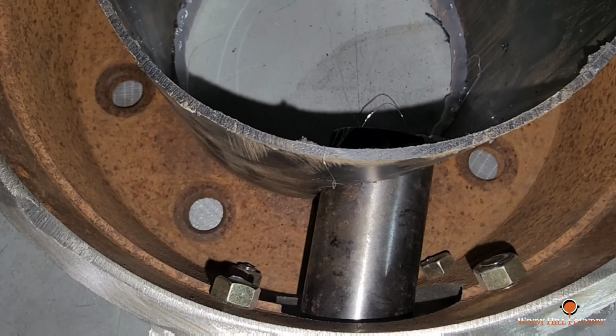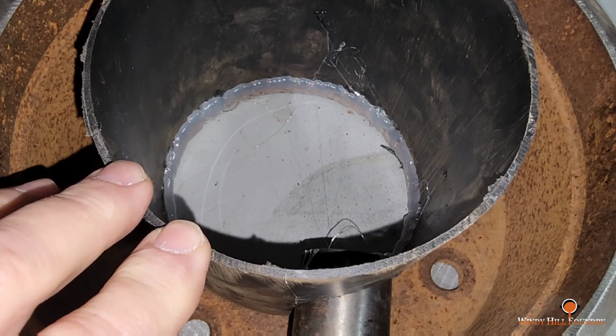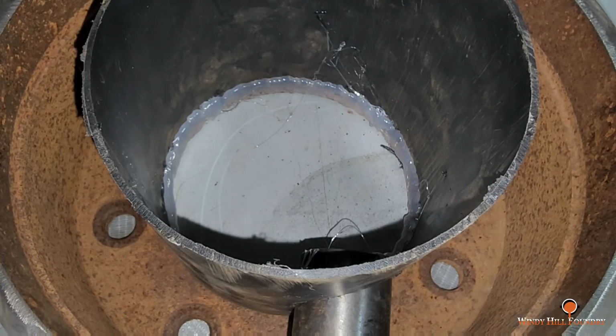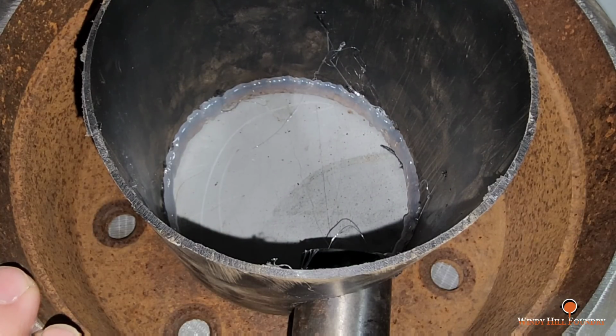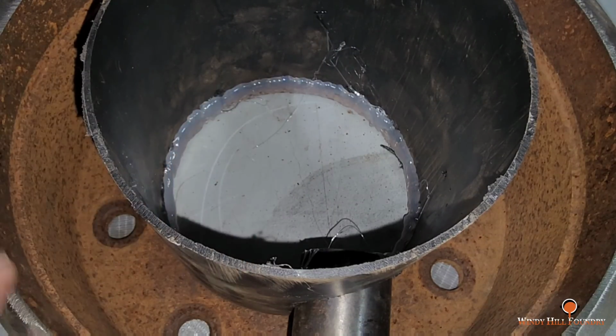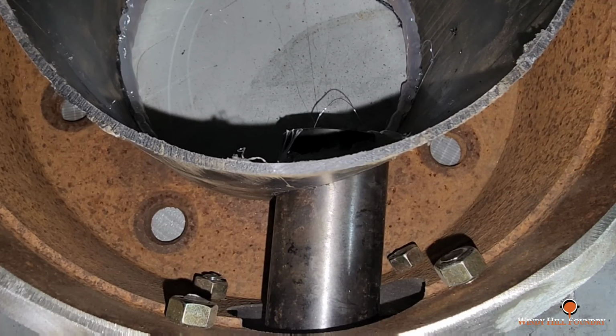One of the things about pouring refractory is you can't have any porous surface against it. We use a cardboard tube for the bigger furnace, and then we have to wrap plastic all around it and tape. It's a time-consuming process just to make sure we can seal the moisture. We don't want any moisture getting pulled in like a wick into that cardboard. We don't have to worry about it with this. This is black plastic. For those that are concerned or thinking this offset is not enough, it's perfectly fine.